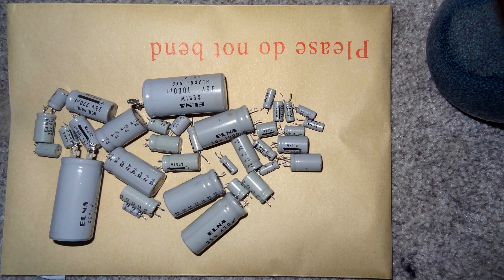The power supply capacitors are ELNA — on this particular model I actually doubled up on them: they're supposed to be 1000 microfarad so I've used 2200. Every original capacitor in this unit was ELNA when I took them out. I've started using the Ultra Fine Golds because I quite like them — I've tried them in a few others and they seem to sound good, giving a little extra detail.